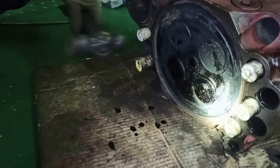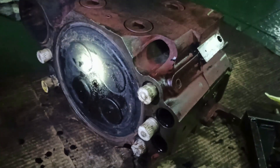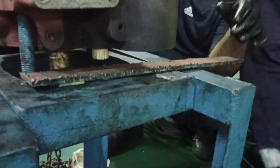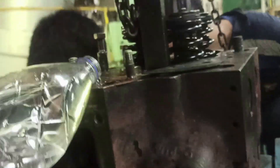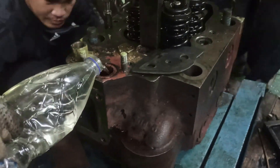To pressure test the cylinder head, we will use round Teflon to plug the holes of the cooling water. Make it tapered and hit it by hammer when inserting on the cooling water holes. Put it in the cylinder head overhauling stand. Use a flat bar if the plugs are not even, so that it will sit properly when you press on the overhauling stand. Put a bottle of water in the outlet hole of the head — this will serve as a marker to locate the leak.